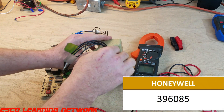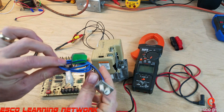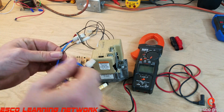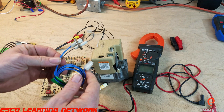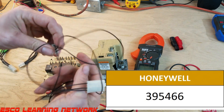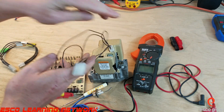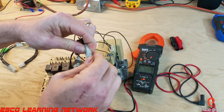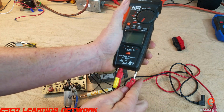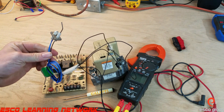The next harness is for the igniter and flame sensor — it's all one piece, all one assembly. If we want to test the flame current, we'd normally have to clip the wire, and that may damage it; when we try to wire-nut it back together we may weaken the flame current signal. With this particular harness, it goes in series with the valve: we plug this end into the gas valve, it's in series with the igniter, and it has two clips that will plug into almost any voltmeter. We set the meter to micro amps, and upon ignition when we get a pilot flame, we'll register the micro amps.